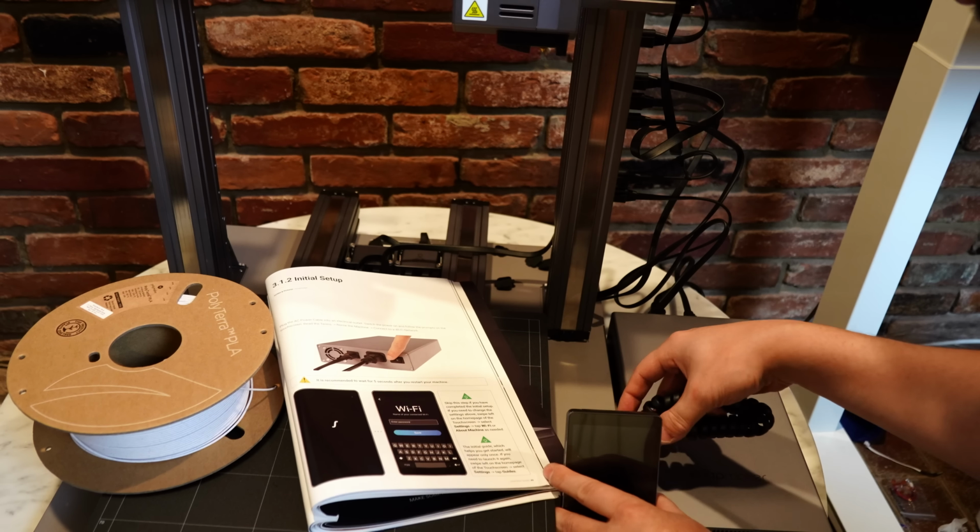So, pretty slick design. I also really like their connector choice here. This is a really sweet connector for the job because it handles your heater cartridge wiring as well as the thermistor wiring all in one plug. So this is pretty sweet. I would like to see this used in more printers. Aside from those ceramic heater core hot ends that I like to use, this is probably the most minimal design I've seen.